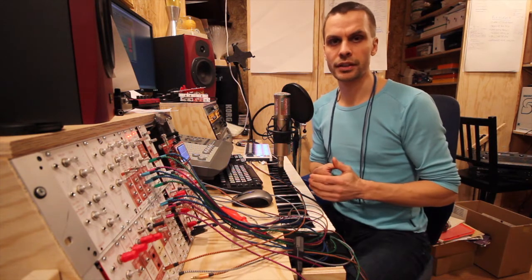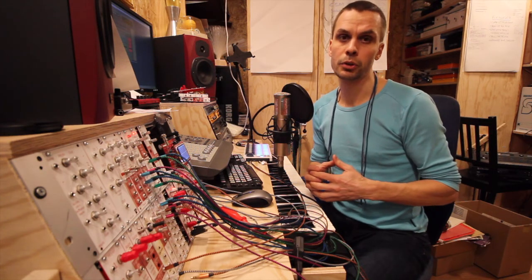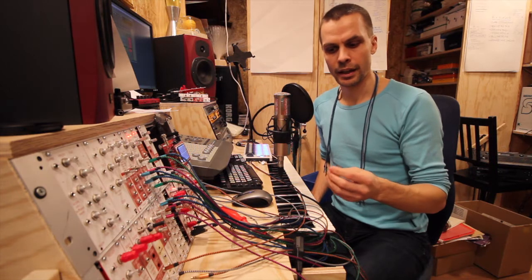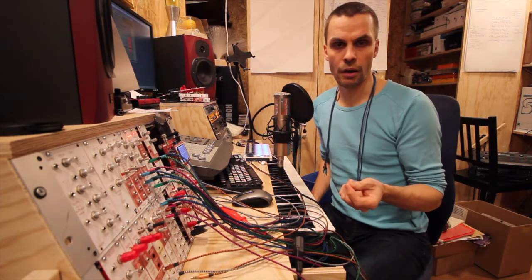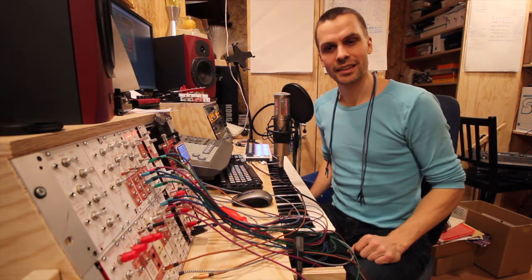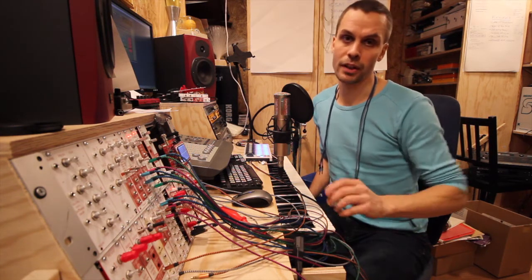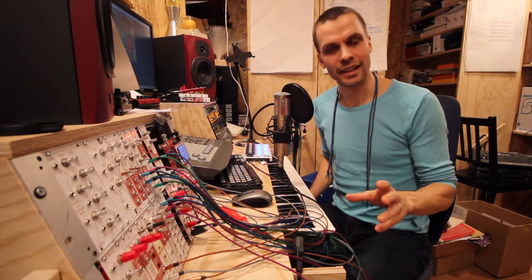So while researching this video, I realized that the circuit I'm going to build is a Jürgen Heibel 720 VCF. So Jürgen Heibel did a reverse engineering of the Korg 35 VCF and built a filter around that. And even though the schematics I have from 2007 don't have his initials or anything like that, while looking at the Jürgen Heibel schematics, it is very much the same. So that is where the credit is due.